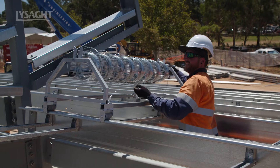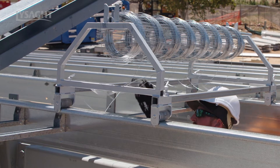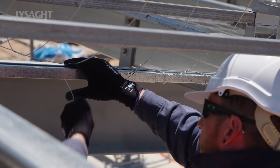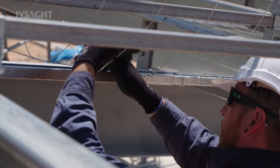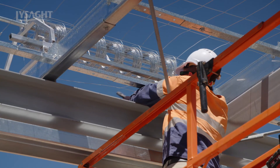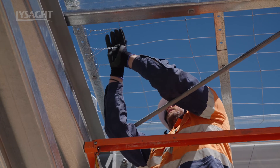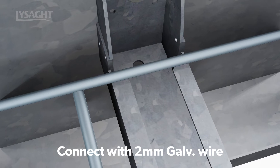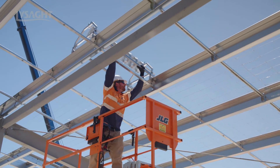Locate wire and wire trolley on the roof purlins. If the purlin spacings are less than 1300 mm, cut the safety wire rolls to suit the purlin spacings — this is easier completed on the ground. Connect the safety wire to the first Superbridge member as per Australian Standard 4389-2015 and roll it out along the purlin run. Tension the wire at the end of each run allowing for a 20 mm natural sag between the Superbridge members and affix to the last Superbridge member as per the Australian Standard. Connect safety wire to each Superbridge member with 2 mm gal wire. Repeat this process to complete roof safety wire installation for the whole roof.